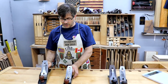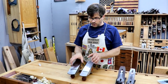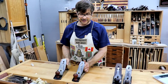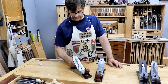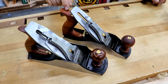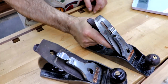A couple of other differences: if you turn them over, you've got a two and three-eighths inch wide blade on the four and a half and a two inch wide blade on the number four. For the same function, why not have a wider footprint — it's going to be more stable in use and you're cutting an extra three-eighths of an inch. Some people think that means it's harder to push, but if you learn how to sharpen, you won't even notice it. The other big thing is the amount of space on what's called the rear tote. The four and a half is comfortable for my hand; the four is very uncomfortable — I'm squeezed to get my hand in there. The Wood River four and a half is also very comfortable, and the Wood River four is not quite as cramped as the original Stanley four, but it's definitely smaller.